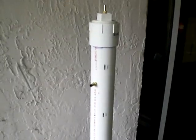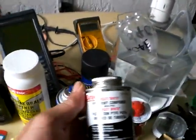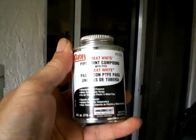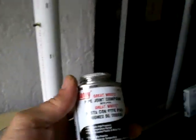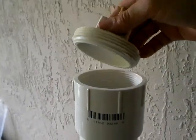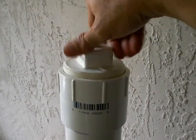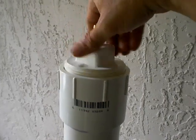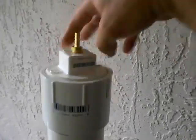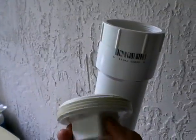I've tried some of this and I don't care for it — there are two reasons. It's a pipe joint compound, supposed to have some PTFE in it. When you use it, it's like a dry paste, and when you screw something in it sort of grinds along. I made the serious mistake of thinking I'd use that so I could take my lid on and off easily, but that thing locks down almost tighter than if you glued it. If I'm trying to make something removable, I want to be able to turn it with my fingers — I don't want to need a two-by-four with a rope and a nut bar to get it loose.